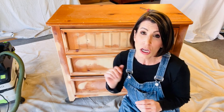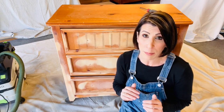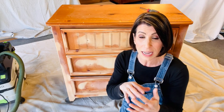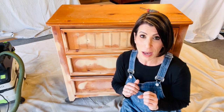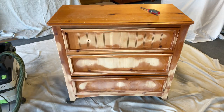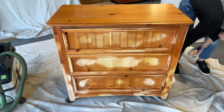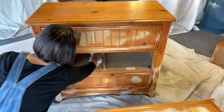Now I'm going to blow it off, clean it, and then spot prime these areas. Normally, any time you take the finish down to bare wood, you want to put a primer on there to give a nice smooth even finish. Sometimes when you paint over bare wood, the paint soaks into the wood grain and looks different than the surrounding finish. I'm using TSP alternative — you can use Crud Cutter or whatever prep you prefer — then I'll spot prime the bare wood areas.